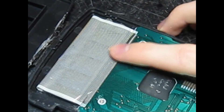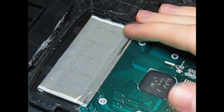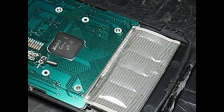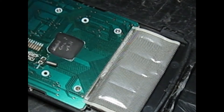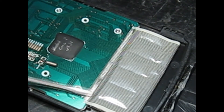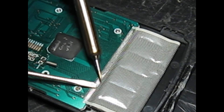So all I'm going to do is reheat them — not directly touch them, because that will melt directly through the plastic with the soldering iron — but I'm going to go over them and sort of hover and reheat these points, and hopefully they'll come back to life. You're actually going to need the screwdriver either way, because you're going to want to push them down with the screwdriver while going along with the soldering iron, and just go along and let the heat transfer to these pins.